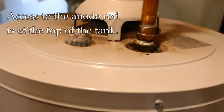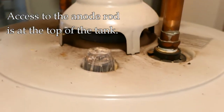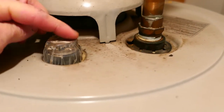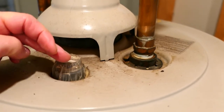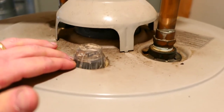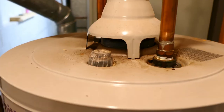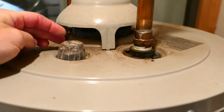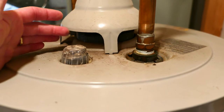Here at the top of the tank is what we're talking about. This can look different on different water heaters — often it is a hex nut, although not always. Sometimes this hex nut is buried below the metal surface, so there may be a plastic cap you need to dig out to expose it. This particular one looks like it has never been touched — it's still got the factory plastic on it.